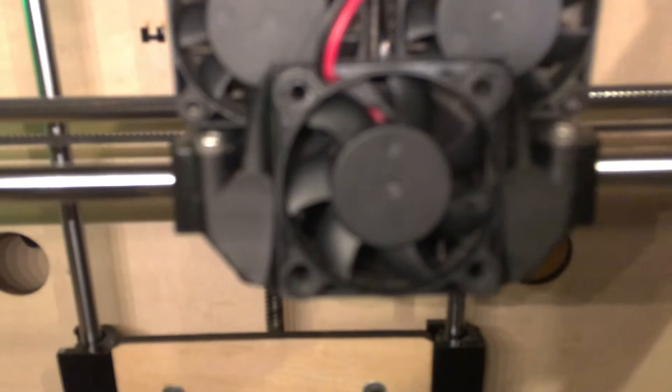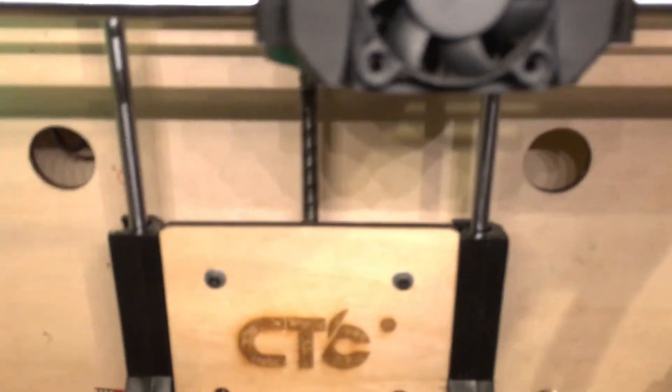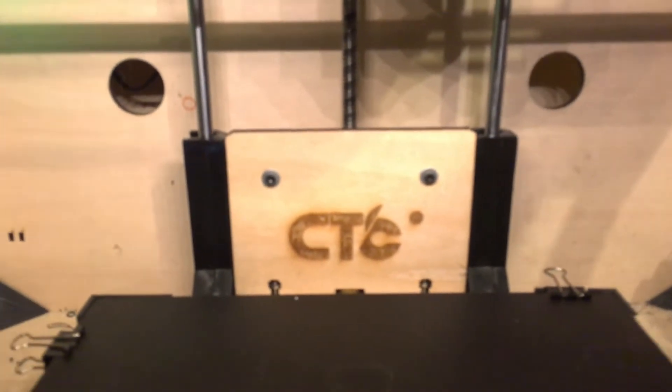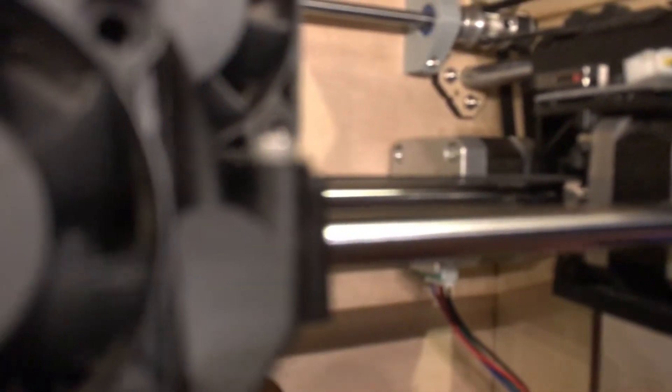As you can see from what I just showed you, I have active cooling which doesn't work very well with the zoom. I'm going to take it out of the little holder I've got it in so I can get where I want. Under here it blows air all around both the heads so that the PLA gets cold really quickly and I can do much better bridging than I could before.